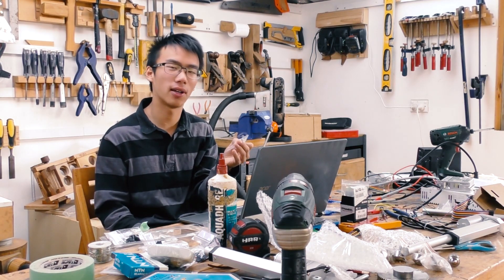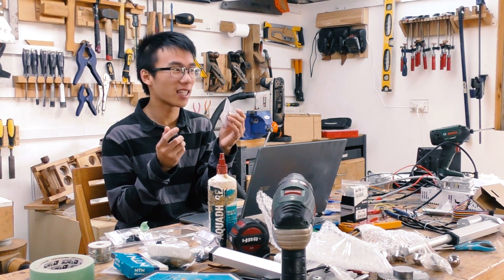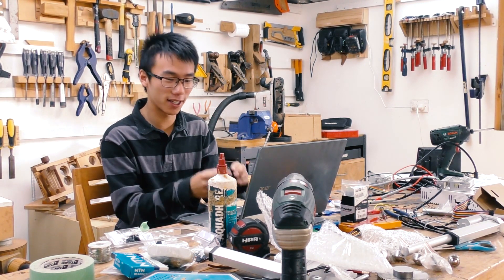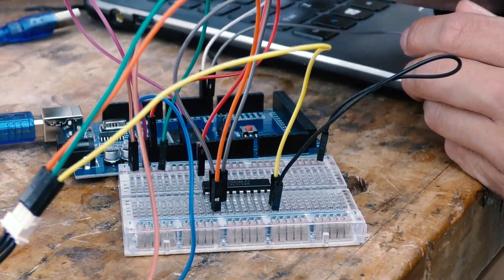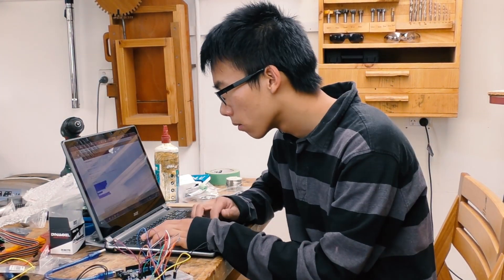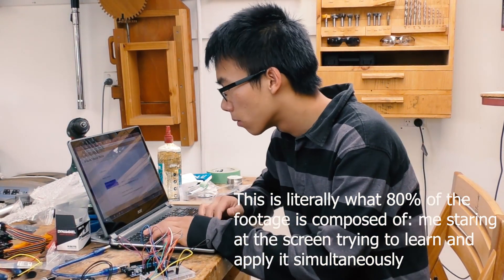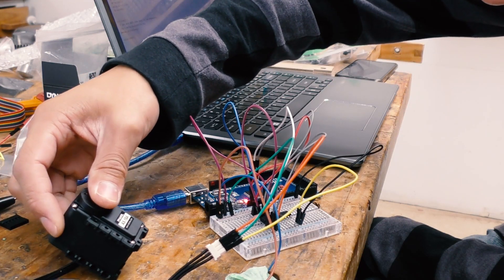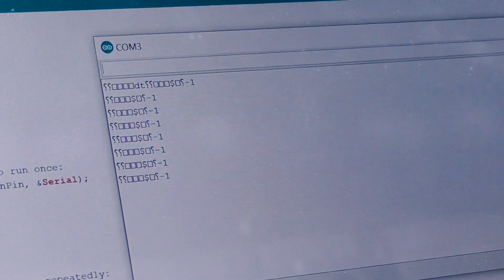I actually need to convert the half-duplex to full-duplex communication. So I followed a tutorial on how to make one of these things move and control it, just banking on the tutorial working. Using the tutorial, I bought a tri-state buffer and tried connecting it with the Arduino and the servo motor. One of the biggest challenges in this project was being quite inexperienced in coding, which made it so much harder to translate my ideas to the Arduino. Whenever I used a new Arduino library or advanced code, I had to quickly learn what each part meant to apply it to my own situation.